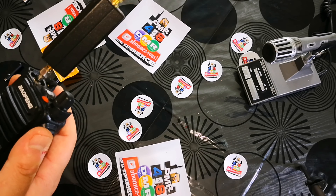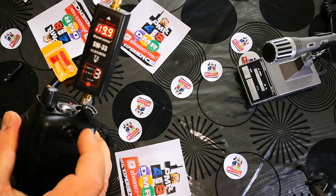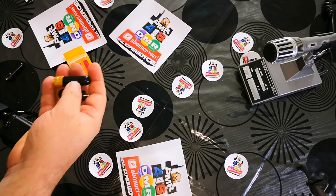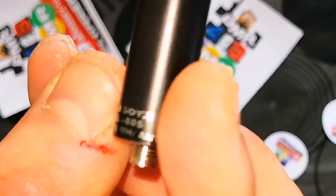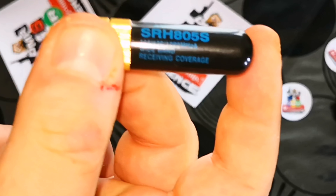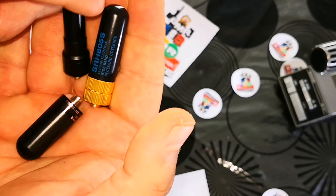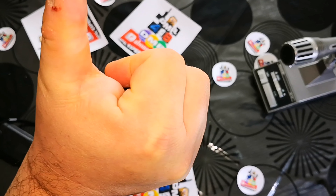Let's go back to the Nagoya, which is normally a bit smaller but is bi-band — actually tri-band. On 23 cm, 1.2 GHz would be better. Currently on 146 MHz. I'll show you the SWR — channel 19. On 144 MHz: SWR 2.2. It's pointless — there's nothing VHF in there. Honestly, it's terrible on VHF. In UHF it's still somewhat usable.